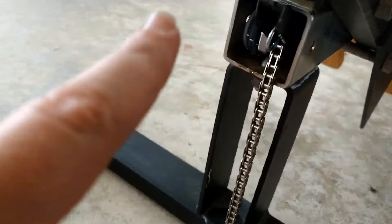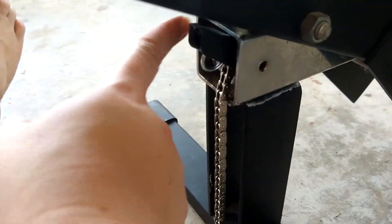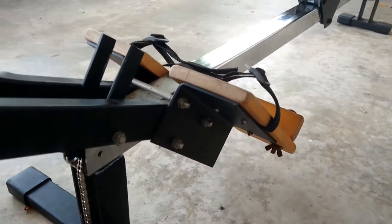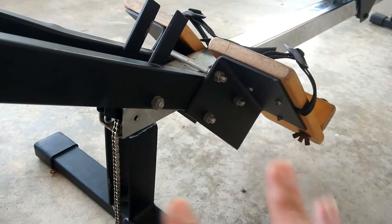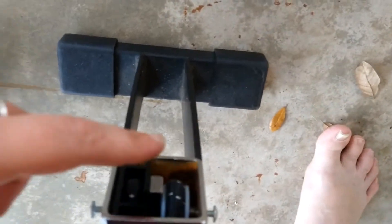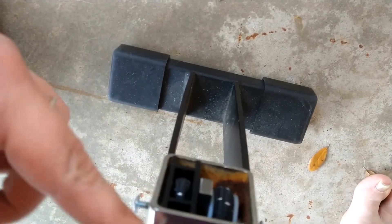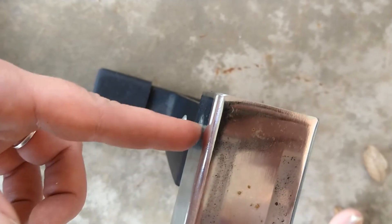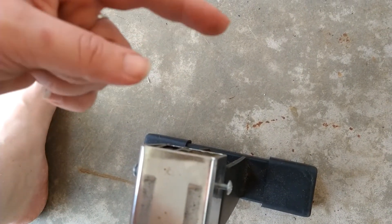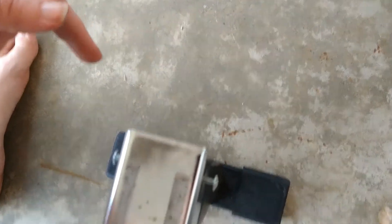I've got the skewer assembly pushed all the way in. There's a pin holding my chain, and at least the screw hole for the pulley here is lined up — it'll be lined up on that side too. I'm going to go check the back down there. The booklet said to sit on the seat and tighten the right side first, then the left side, so we're going to do that. I have the skewer assembly in; you can see it inside the monorail here. I've fixed it so that the support piece for the shock cord is square and even with the edges so it's not poking out, which allows the screw to go into the socket correctly. The ones on the other side are also in place. I'm going to do the right side ones — which are here when you sit the correct way on the seat — and then the left side ones.